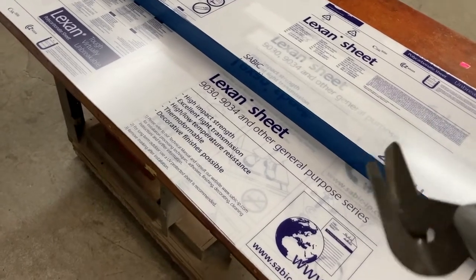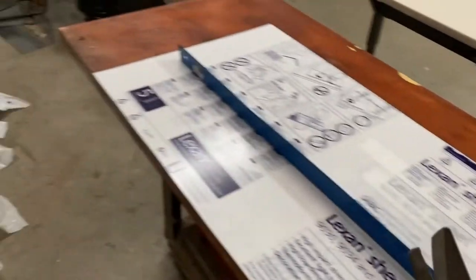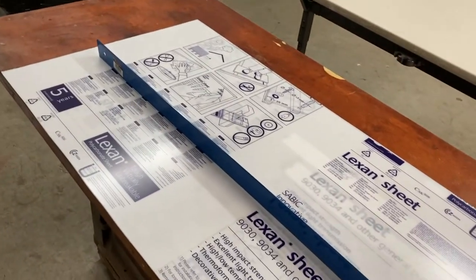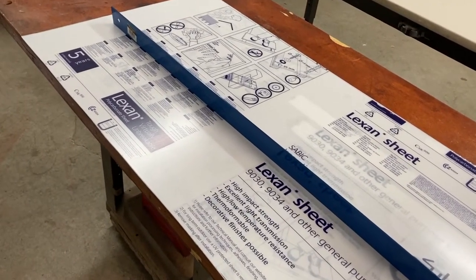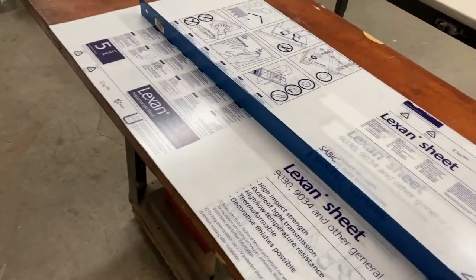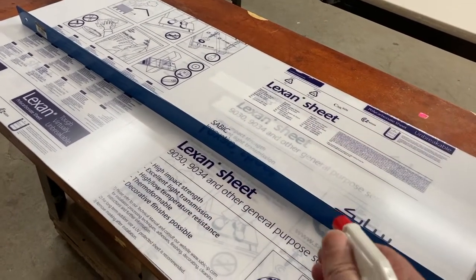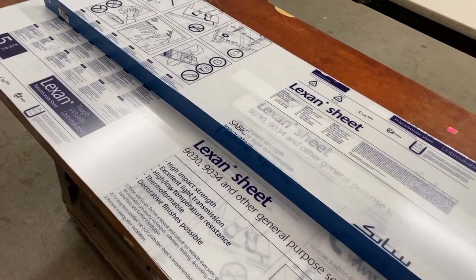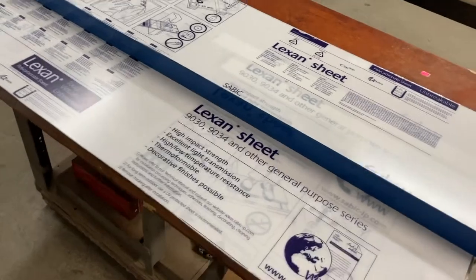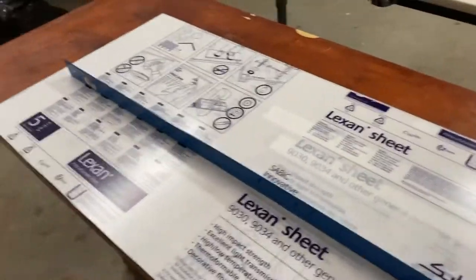If you mark it like I'm doing here with a straight drywall edge guide, mark it and then cut it. I've got two sheets here, and sometimes when you're doing two sheets at the same time they'll slip and slide around. What I do to fix that is come in and spray between the layers a little cleaner solution I use for wiping it down — that makes them stick together so they don't slide apart.